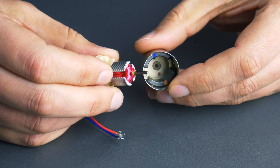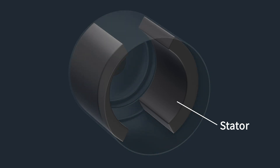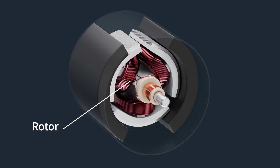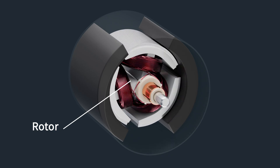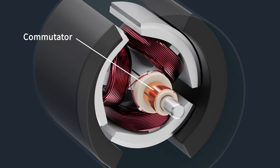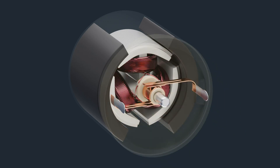There are really only four pieces of the motor and no electronics. First you have the stator, which is the stationary part of the motor and is typically made up of permanent magnets, though it could be an electromagnet in larger industrial motors. Then the rotor or armature is the rotating coil that generates a magnetic field when current is flowing through it. The commutator is a mechanical switch that switches the direction the current flows through the armature. Finally, the brushes — from which brushed motors get their name — are the contacts that transfer power to the armature.